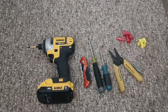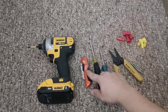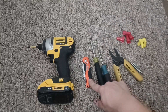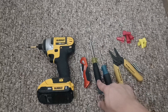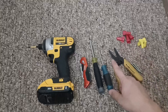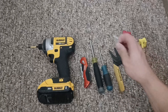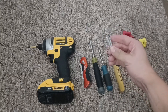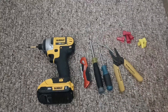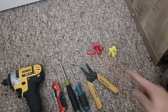Here are the necessities you'll need to mount your horn strobe and install it in your own fire alarm system. You need a drill, or in this case I'm using an impact gun, a razor knife, a screwdriver — in this case I'm using a tech screwdriver, a 27-in-1 meaning it has 27 different bits — a flat head or phillips head screwdriver. You need a wire stripper, 6-32 or 8-32 screws (in this case I'm using two 8-32s), and yellow or red wire nuts depending on how many wires you're using.